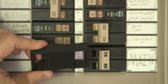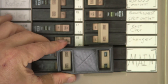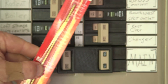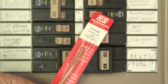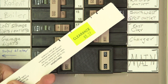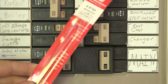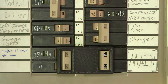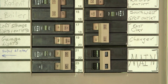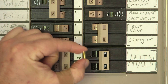So I've got my 3D printed part, and I printed it with eighth inch holes in there, then I reamed those out with an eighth inch drill bit. A while back I was at a local store and I saw they had a closeout deal on all of their little pieces of hobby metal — brass and things like that — so I bought every last piece that they had. Now I've got brass rod when I need it; this was 37 cents. I bought like 20 of these rods and tubes, various sizes and shapes. This is a nice size for going right into that little pocket in the end. So I took my brass, cut a couple of pieces, and just made some little pegs.